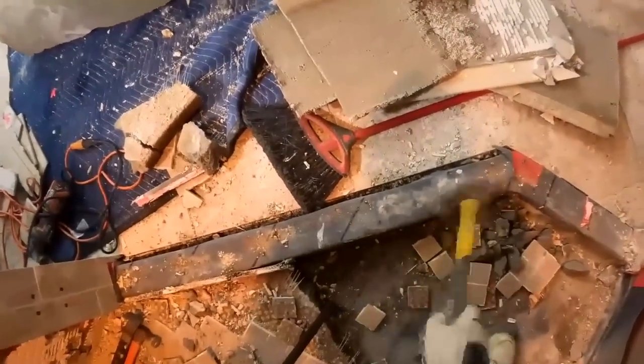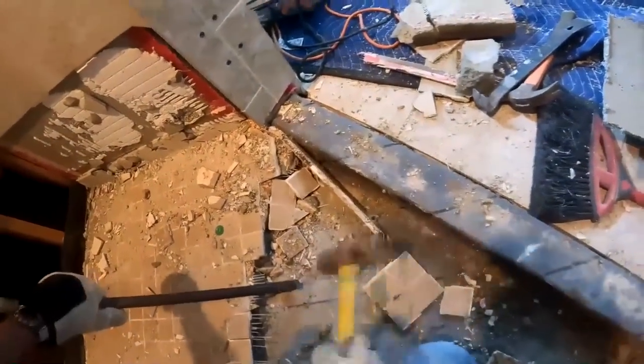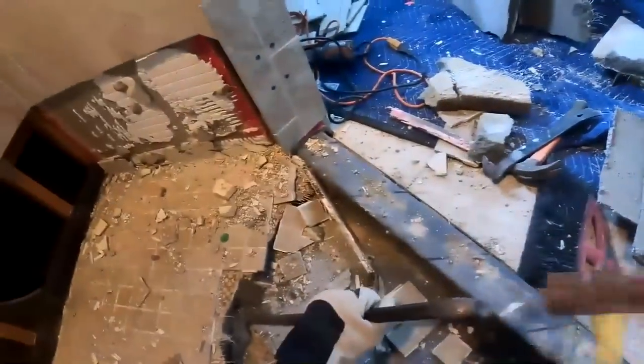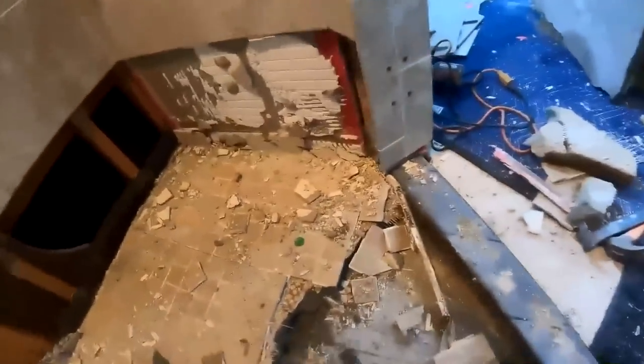The main reason I take out the P-trap on every redo job that I do is because I don't know how much of the gunk the other contractor threw down the drain, and usually it's pretty pervasive. There's mortar, there's thin set, there's grout, all kinds of things clogging up that drain. So although it might still drain, it might drain slowly. I've seen some 2-inch drains where you might be able to get a Sharpie down the drain. I mean, that's how clogged up they are. And so for that reason alone, I usually swap out the P-trap just beyond where the P-trap begins under the floor.